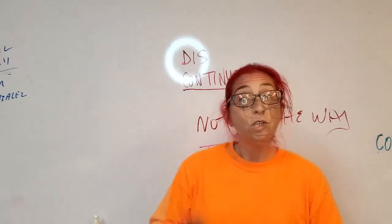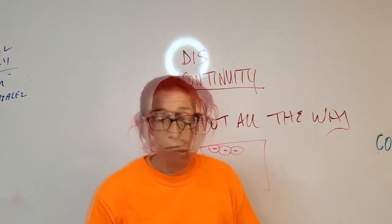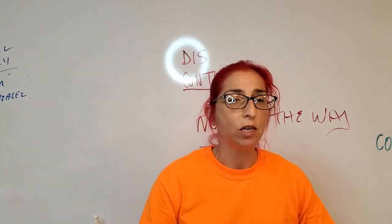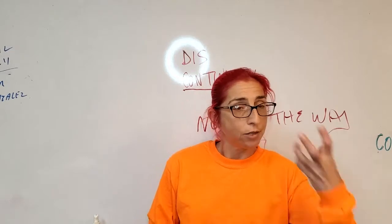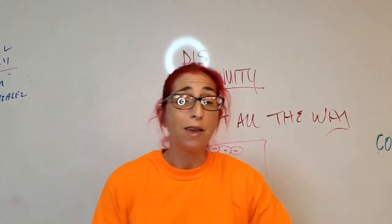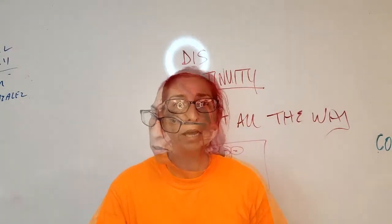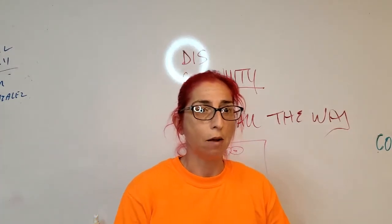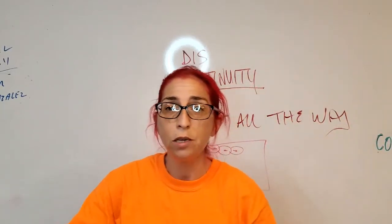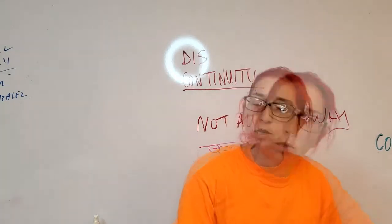Okay, how do we fix it? What's the solution? Not just angle, arc length. Arc length is essential if you're getting porosity. It means you're too far away, especially if you're running stick. What happens if I'm getting porosity with MIG? Well, MIG has a gas. It doesn't have a flux that's creating that atmosphere. So that means my gas could be blown away. It also means that if my equipment is dirty in my MIG, it impedes the gas flow, which means I might not have enough to shield it. So we have to think of all those little different things. Or my gas isn't up high enough. It's that trickle that's barely coming out, not able to cover everything.